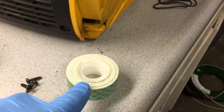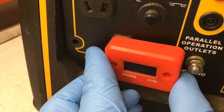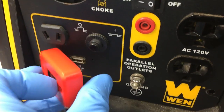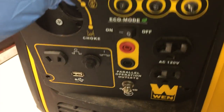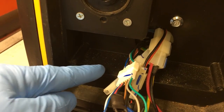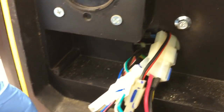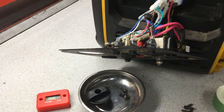I don't use this USB port, so I'm just going to mount it right here with two-sided 3M tape. Then I'm going to drill a little hole right through here to come through and put my pickup wire in this slot. I would mount it lower but I can't — behind here this is in the way and there's no way for me to go through this wall into the cavity. So I'm just going to come through this hole right here and then into the back of the panel to my hour meter.